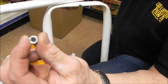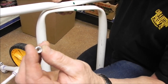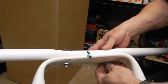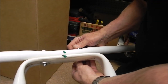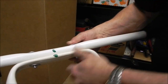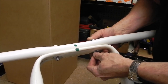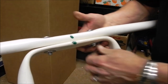These are all locking nuts. They have a round side and a flat side — the flat side is down, round side out. So just like so. You're just going to finger tighten it for now. Take the other one, loosen it, and it should come right off. We're going to push this right down through there, then put the washer on and the locking nut. Once you get this together, you still do not tighten it all the way yet. That's all you need to do for now.